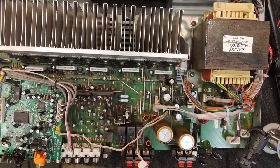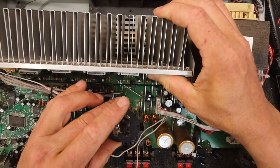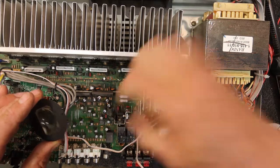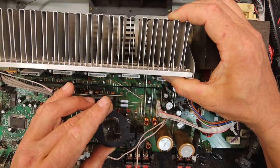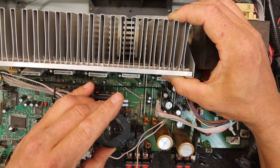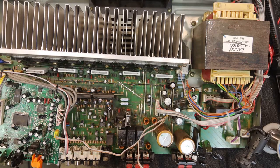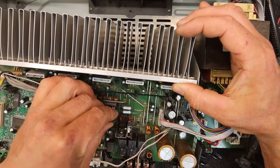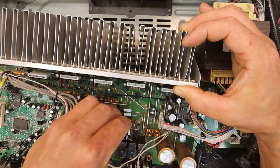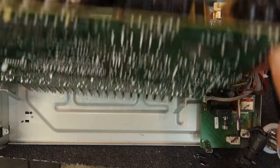And definitely a 47 and it's the right way around. That is C894 or something - C896 I think. And our other one - C808, which was the 100 mic. I'll find a capacitor I haven't used before - negative that way. I'll just poke them down in there. Ideally they'd probably be mounted above the board a bit, but then you do risk them wobbling around too much if you do that.